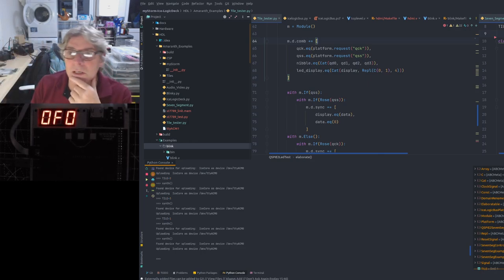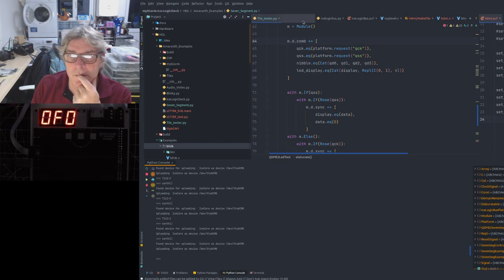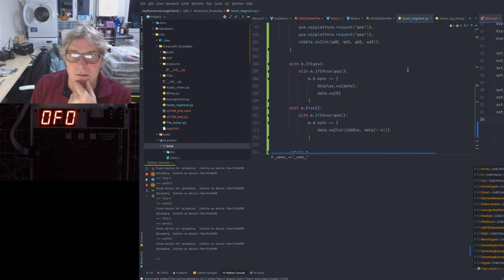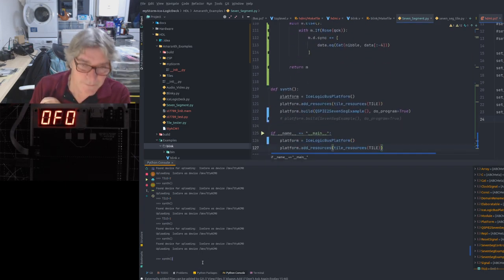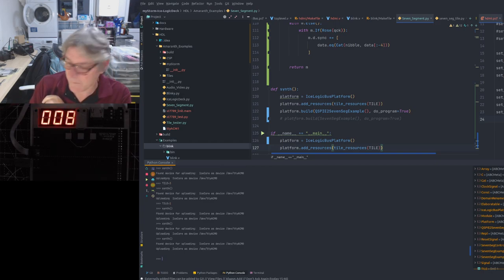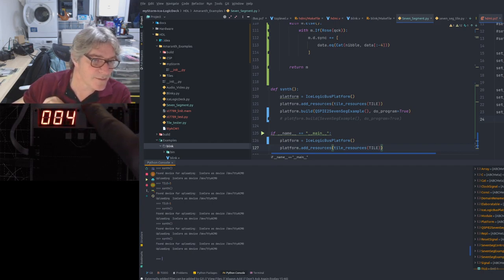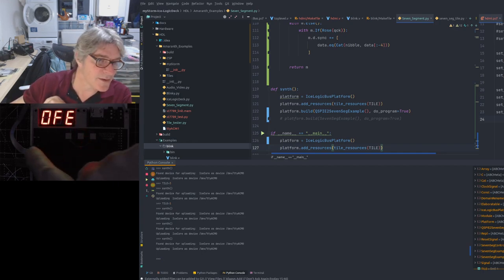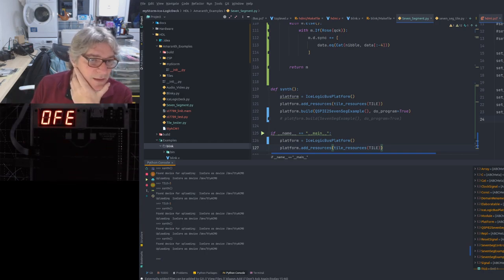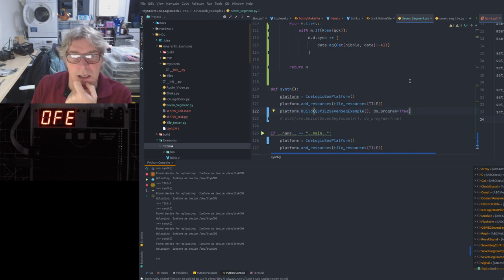So what I'm doing is I've now done a version of the seven segment file. So that now has the QSPI support. So now when I build this, which is what I'm doing here, it programs it and then you can see it counting. That counting is being done in, that's 0 to 255 in BlackCrab. That's a QSPI set of transactions. That's not HDL that's doing a count there. That's just receiving QSPI data that's counting up. And I started cleaning up some other bits as well.